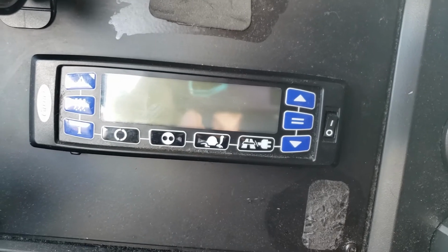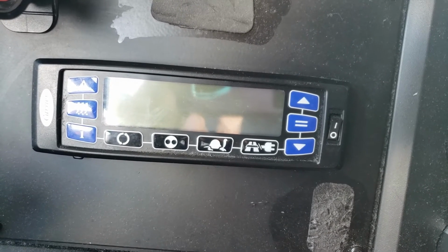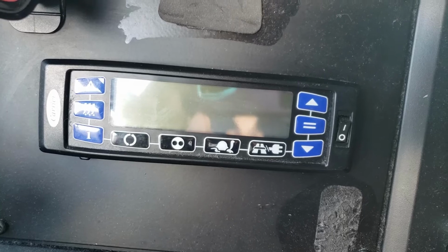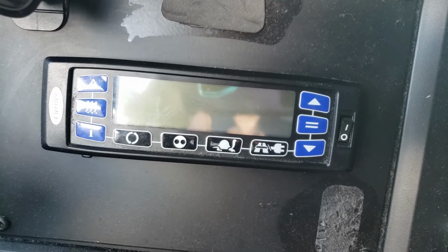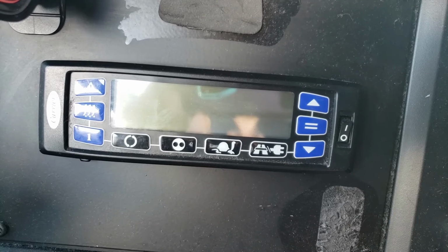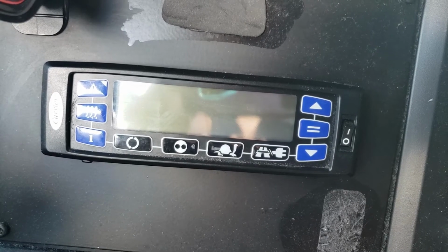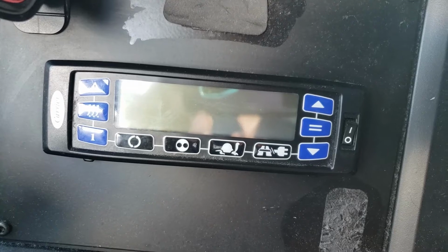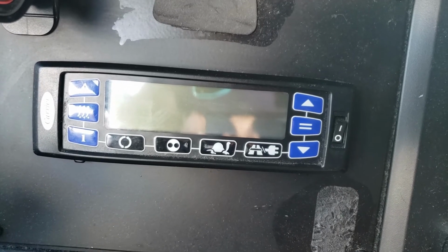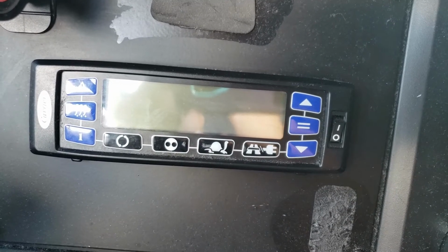Now, another point I want to bring up is the defrost mode. The number on the left is your set point that I was telling you. The number on the right can change during defrost mode. During defrost mode, you may notice that the number on the right rises, and it sometimes will even look to be out of range. But if you go back to your Ameriscan, which we're going to cover next, you'll find that it might still be within range. So don't be alarmed. Use the Ameriscan or whatever system you have that actually controls your alarm and displays the actual probe temperatures. In my truck, we have 4 probes, and they each have separate readings, and that's what I go by, and that's what the alarm is set for, those 4 probes.